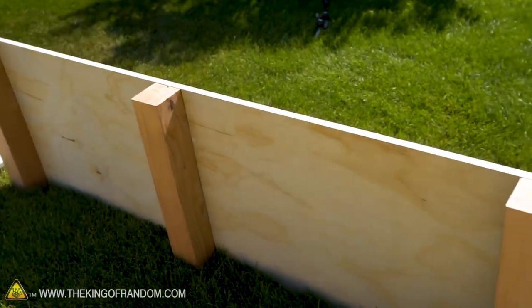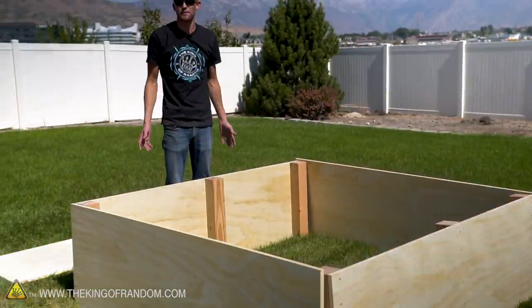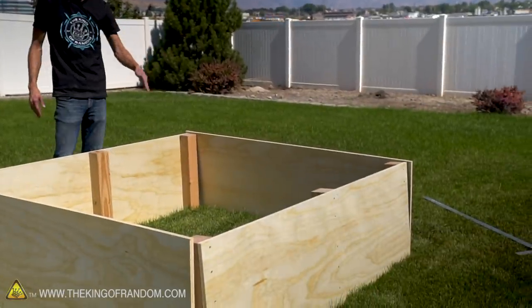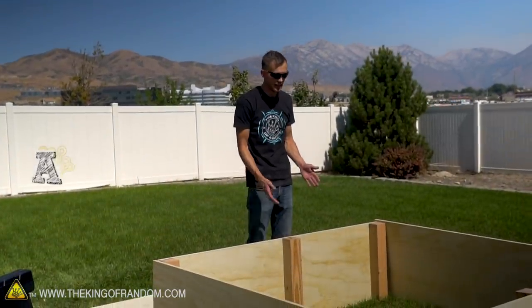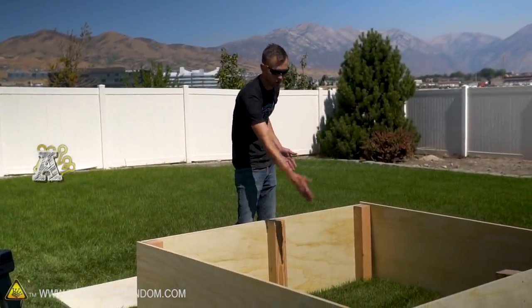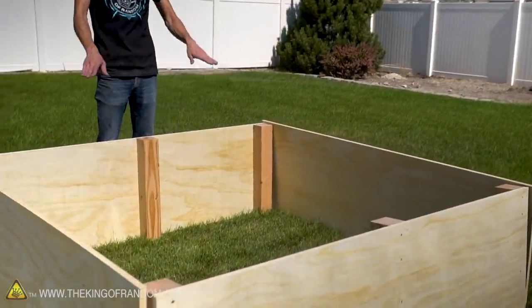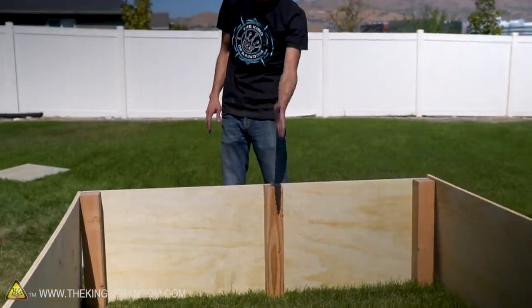You can see the very beginning of what we're going for. The box is definitely not finished, but this will be one of the front pieces near the back. There's actually going to be an extension beyond this, but this is the size of the storage we're going to have inside. Next I'm also going to cut a piece that goes right in between these two four-by-four posts — that will divide it right in the middle and offer support down the middle of the bed.